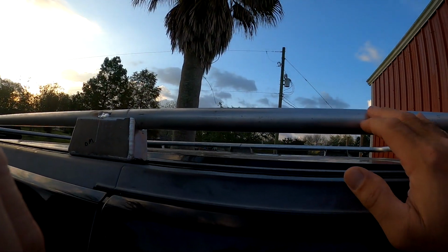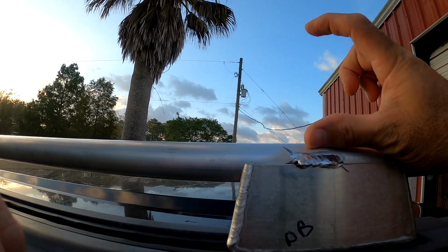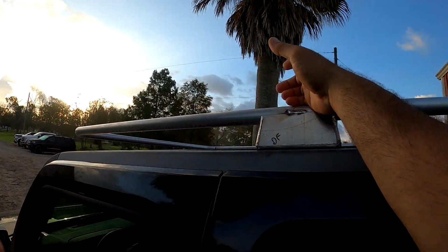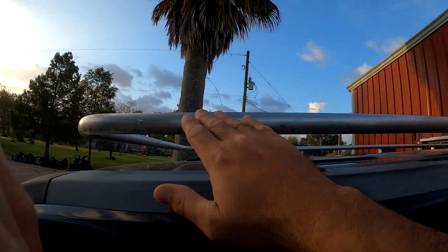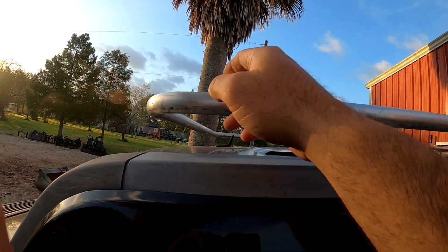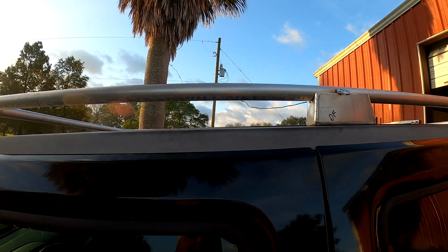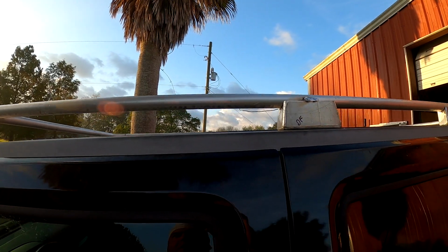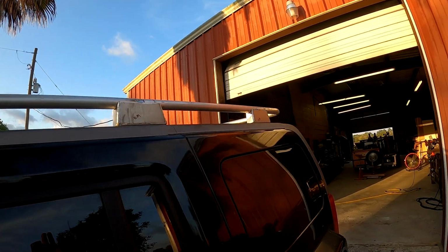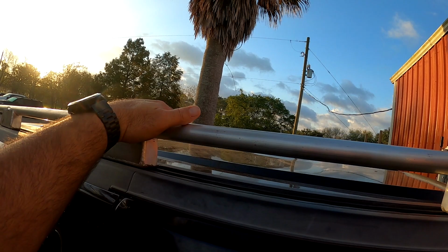So this is gonna be the bottom rack, and then I'm gonna cut some 4-inch pieces for the top, and, you know, put an upright, and then it's 8'4" long, but I think I'm gonna go 8 foot, so it's gonna stop like 4 inches, and then in the front I'm gonna put a plate at an angle. And then I ordered some dimple dies from Swag Off-Road, so I'm gonna put plate in there and dimple die it, and then of course run my bracing across the bottom and stuff like that.